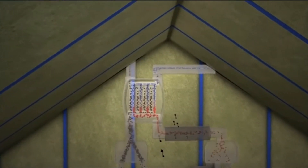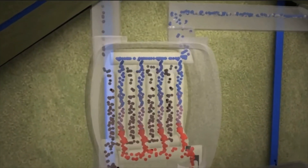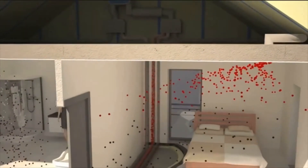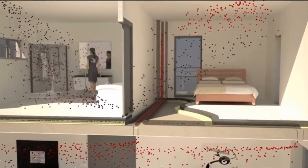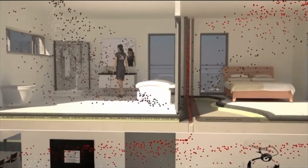The warmed fresh air goes through a silencer to the distributing air collectors. Each conduit is connected to air valves which distribute the fresh air to the bedroom and living areas. The fresh air is blown into the bedroom. In larger areas more valves are fitted to distribute the air equally. Through vents, air flow between different spaces is made possible.